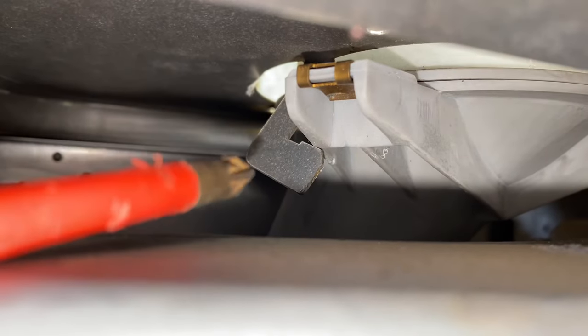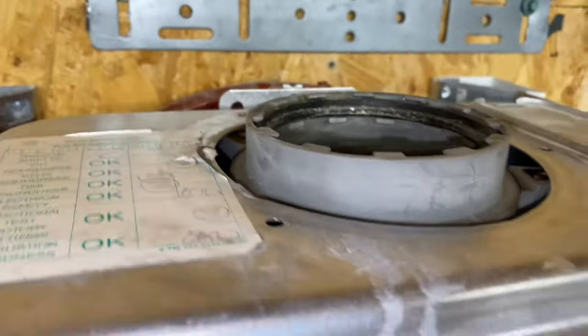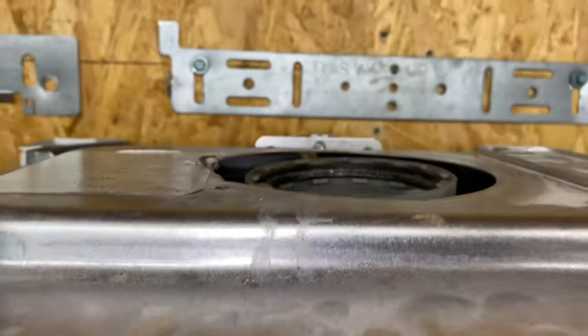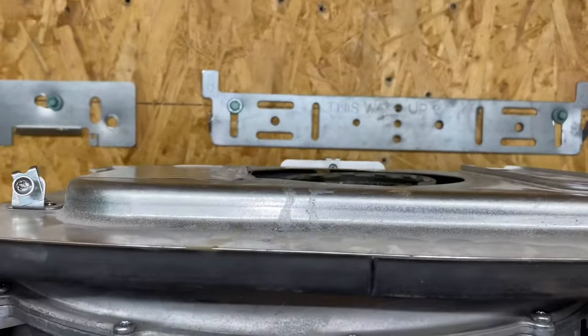It's a little bit awkward to see, but there's a little clip there. With this grey part of the flue, all you need to do is twist it — lift it up a little bit and twist it — and then it'll come away from that clip. Then you can wiggle the flue down like that, and that goes below the boiler and you can just slide the elbow straight off. It comes off really easy.